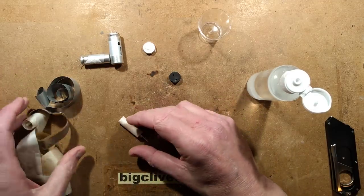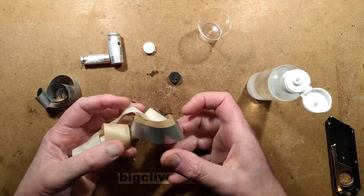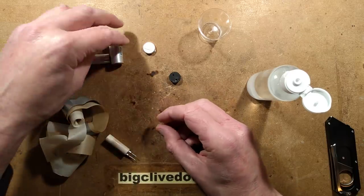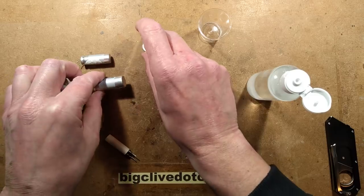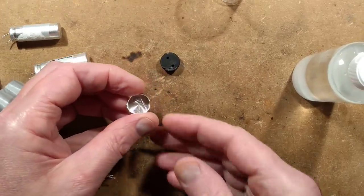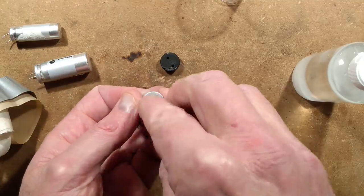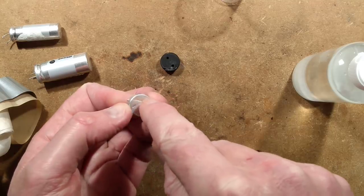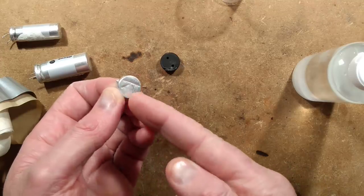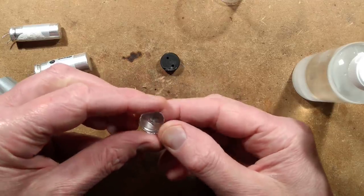The reason these explode when they fail is because they do have liquid inside them. When something goes wrong, that liquid starts bubbling — it could be heat, it could be a chemical breakdown. Pressure builds up, and that's why there's a little shape scribed on the top. Let's zoom in a little bit. It's clear that something's gone in from the inside and it's been embossed from the outside to create that slight V — a weakness. It's deliberately got sharp edges, a sort of V-point at a flat surface to give a breakage point.